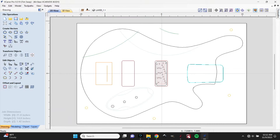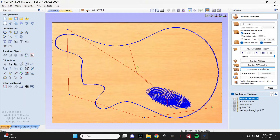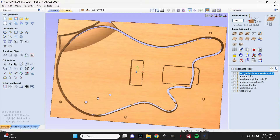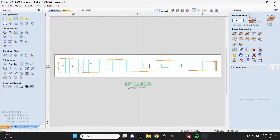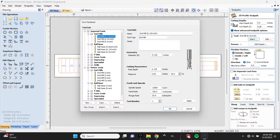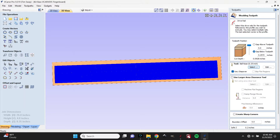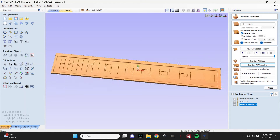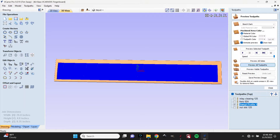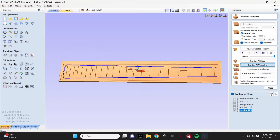Once we got the neck figured out, the rest is going to be easy. The body is mostly two-dimensional cuts — just cutting out shapes and holes. But you can see I did that same molding toolpath trick to give us the cutaways for your belly cut and your arm cut, giving the illusion of a full 3D carve. For the fingerboard, I created a 12-inch radius by drawing a 24-inch circle and selecting a piece of it to do a molding toolpath. I just created one line on the edge of the fingerboard outside of it and rounded over a big giant swath of a 12-inch radius, then cut my fingerboard out from that. We can talk about router bits too — you might need some specialty ones. I'm using a very small end mill to cut the fret lines, but you could also just score them with a small V-bit and finish by hand with a saw.